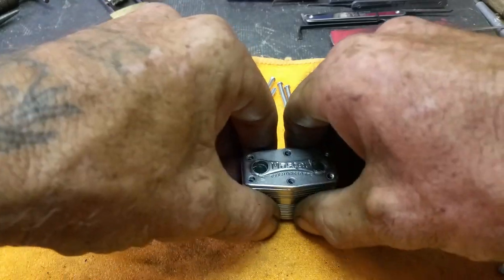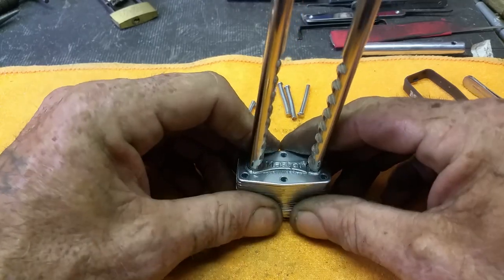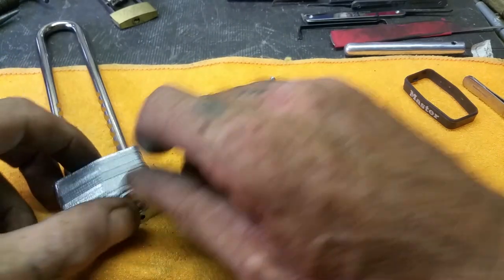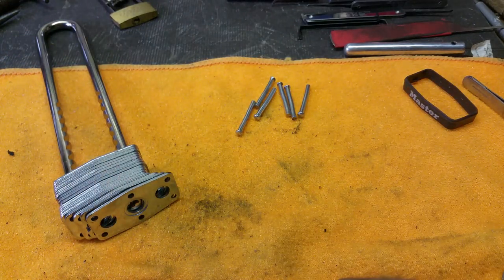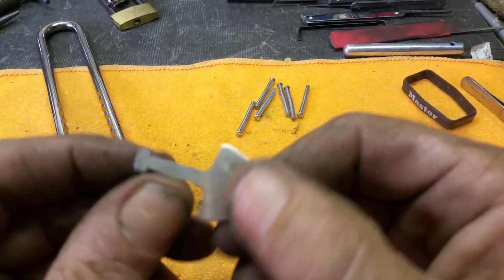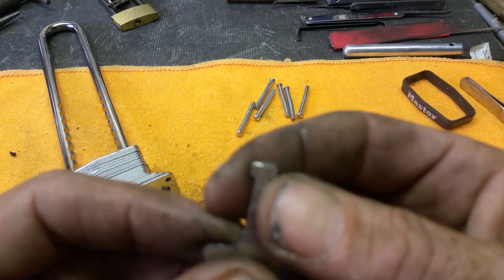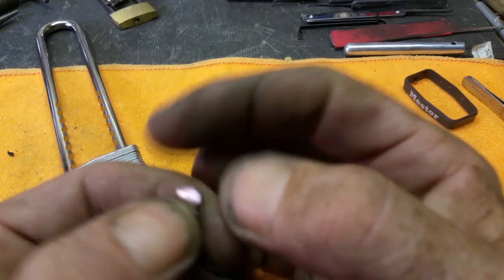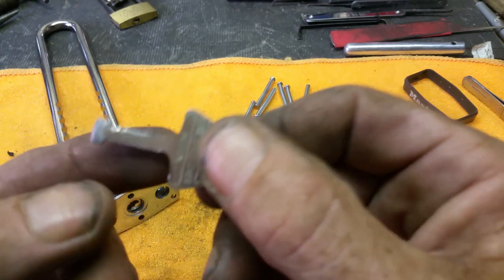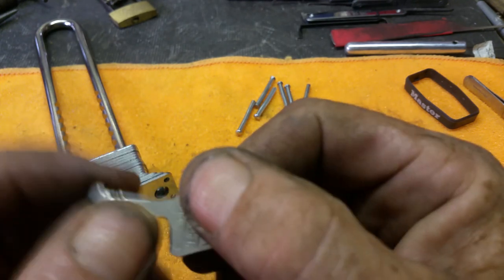So basically that's it. And obviously the shackle goes through there. So that's the 517 exploded. Basically you can make your own key up pretty easily. All you need is, as long as it's thin enough to get through the wardings and it's got the T-piece at the end wide enough to retract the locking pole, basically you could, in theory, unlock all the padlocks on the 517 series.